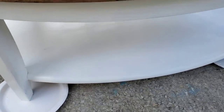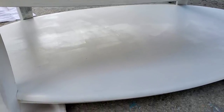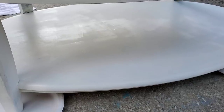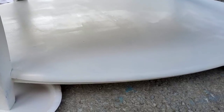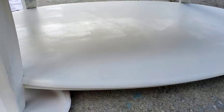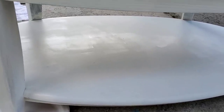So I wanted to give you guys an up-close look of how the table was looking after two coats of paint, and so far it was looking really good. You can definitely see the brush marks and the paint roller marks — that's really normal. The more coats I add, the smoother the finish gets. With the flat paint, I feel like it goes on a lot smoother and a lot easier than chalk paint. Chalk paint can sometimes be a little thick, but the flat paint goes on so nicely. I will definitely keep y'all updated on how it holds up over time.